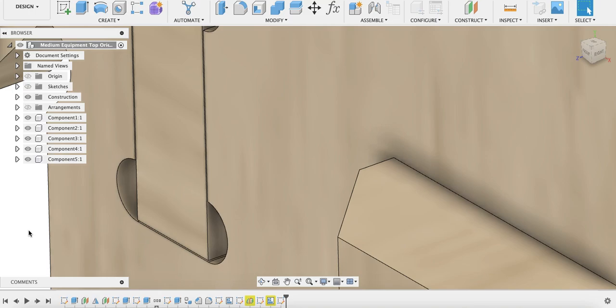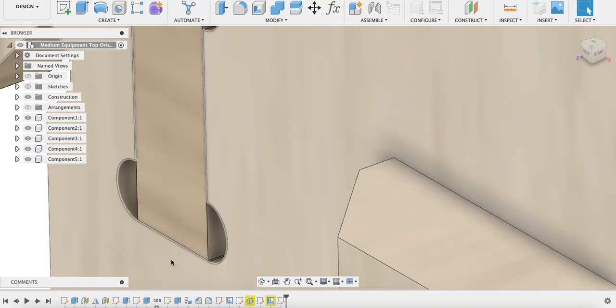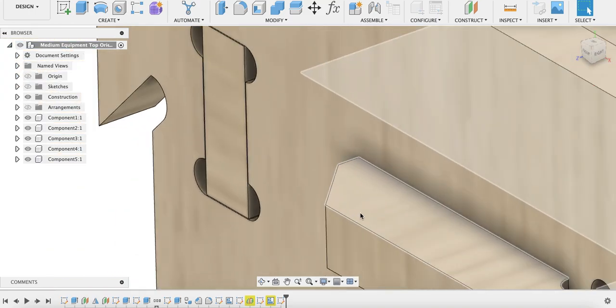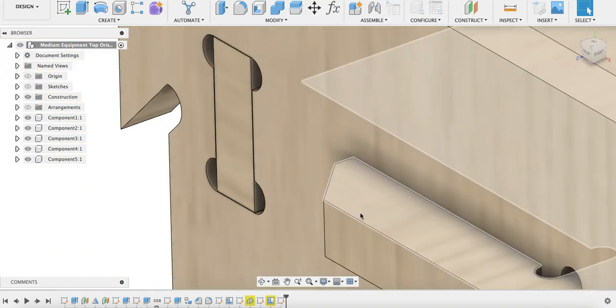So all my designs are actually larger in width. All the holes here are slightly larger in width and length than the material thickness. I found the perfect size larger that it needs to be in order to get the right balance of durability and tightness, while also being able to assemble and disassemble it easily.